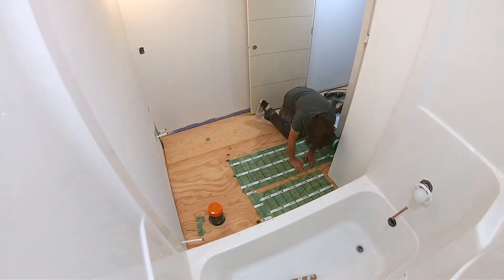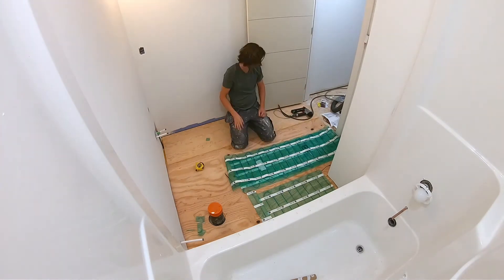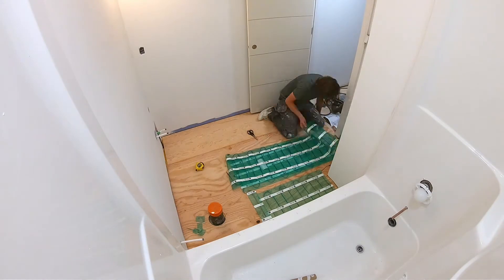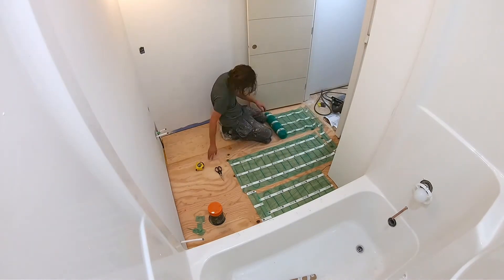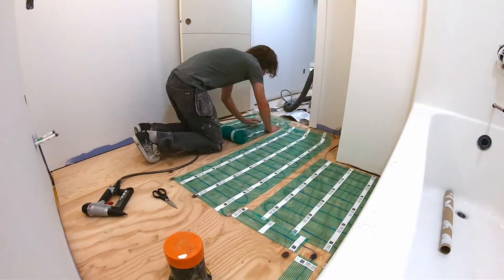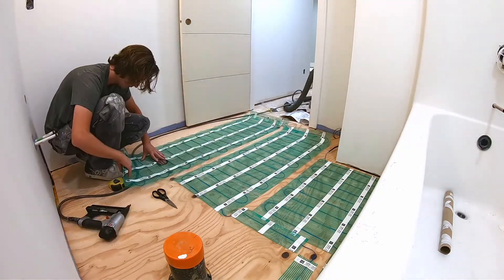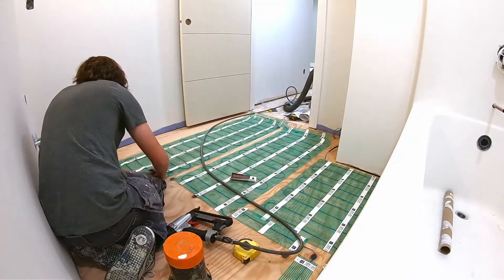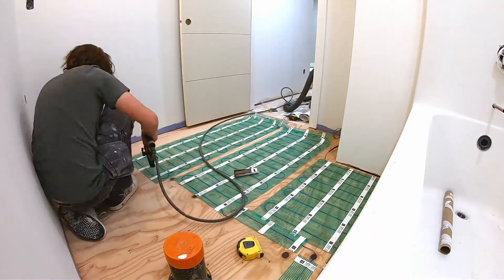It's just a case of unrolling the mat, making your cuts, and getting all of your heating cable down where you want it, making sure you maintain the spacing between the coils. These white bands are actually double-sided tape, so you can peel them off and use them to adhere the mat to the ground — I didn't realize that until the end of installation. I went back and used my air stapler to staple the matting down, making sure not to put any staples over top of the heating cable, as that would potentially cause a break in the wire. Any attaching you do should be to the green matting itself, not the heating wire.